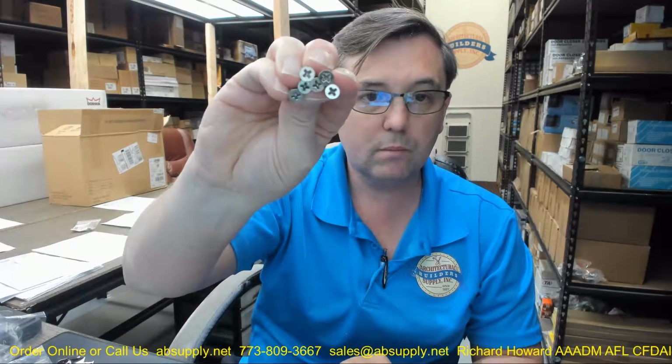Now, there is the rim strike. Let's take those dimensions so we have those recorded. 2 inch tall. Overall width of the strike, they've got it 1 1/4. I would say that it's closer to 1 5/16. Then, of course, your 6 screws, those are going to be included.